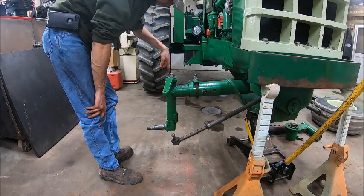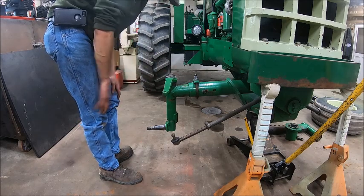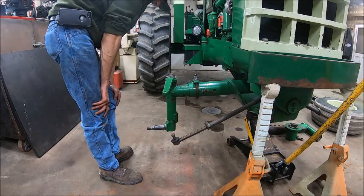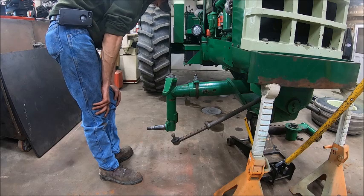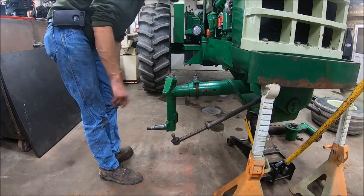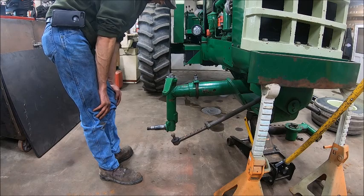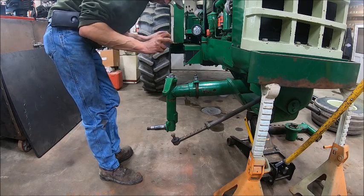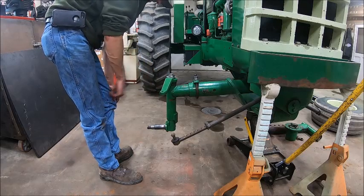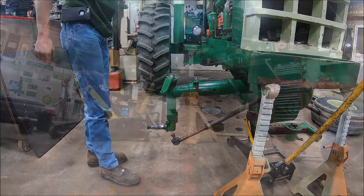And they don't give you a torque for this bolt either, so I'm probably just going to run that thing, get the tie rod and everything in there so it's held tight, and probably just going to run that one up with an impact, because that's an inch and 5/16 I think is what them threads are, so I don't think that impact will go high enough to torque that nut to what it's actually supposed to be. For something that big, you're probably talking an ungodly amount of torque to torque it to spec. But anyhow, put the tie rod in, tighten that up, fold the washer up so that it's locked down, then we can start on the hub.